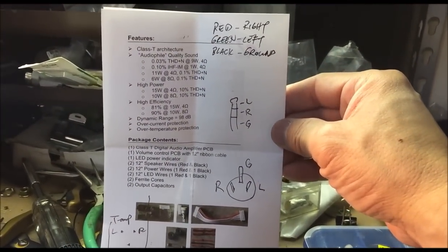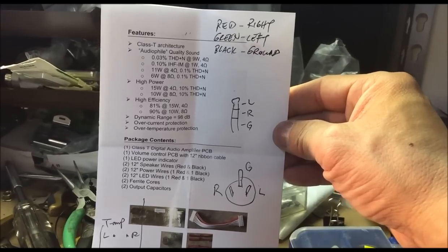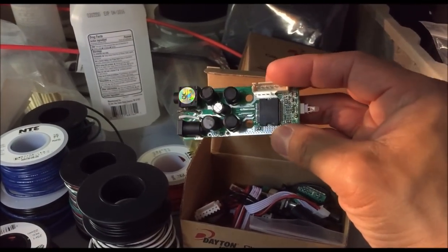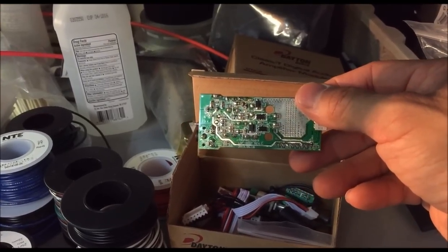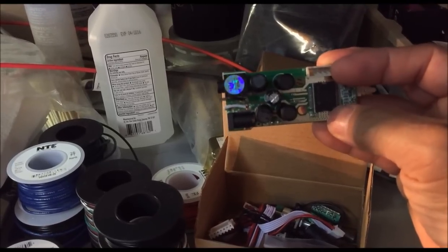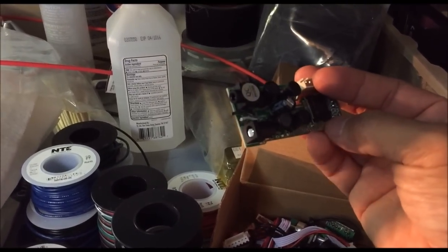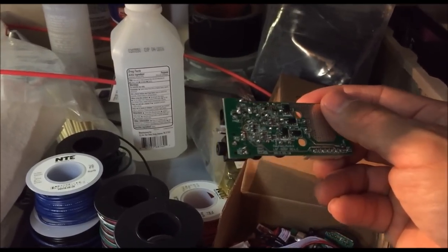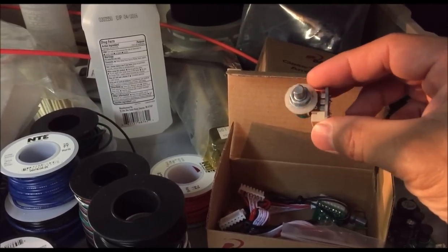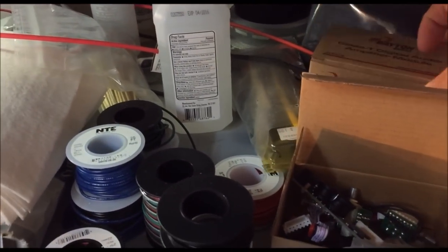This is the spec sheet for the 15-watt Parts Express T-Class amp. I have a couple of spare ones here — here's one that actually burnt up and I got it replaced under warranty; it just somehow smoked. But as you can tell, it's a very small form factor and very easy to wire up. You will have to solder power going in, and also speaker left and right coming out. It does come with a 2.1mm by 5.5mm jack and a 3.5mm stereo jack, but I always like to solder directly to the back — it saves space and makes it a lot cleaner. It also comes with a potentiometer for on/off and volume control. It's a very nice amp for 20 bucks.